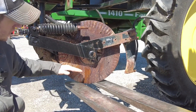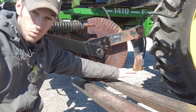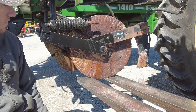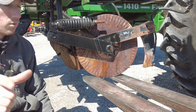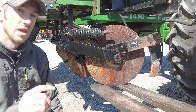As we apply upward pressure, that simply brings that knife up out of the ground. Our depth — depending on how deep we're running — is somewhere right in here, so we're running right on top of the ground. Our displacement point is right back here, so we're just distributing fertilizer right on top of the ground. The harder the ground gets, the worse this scenario gets.